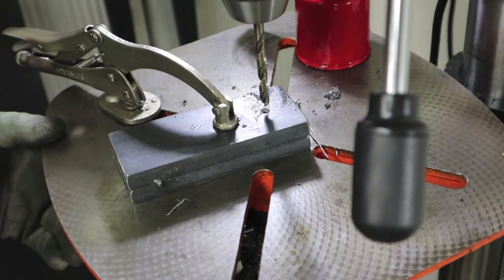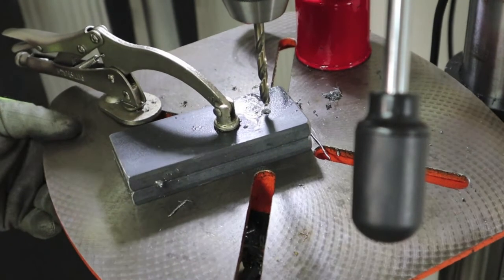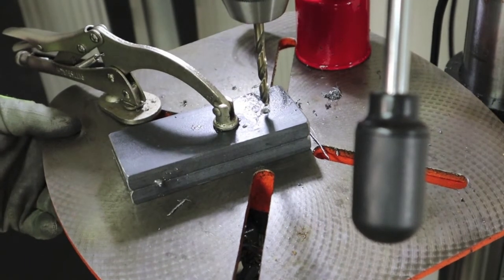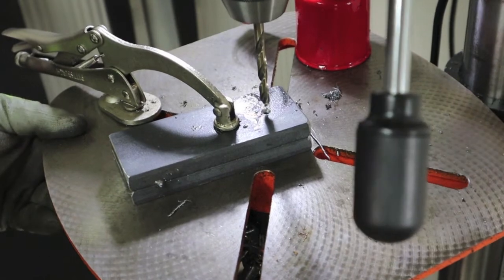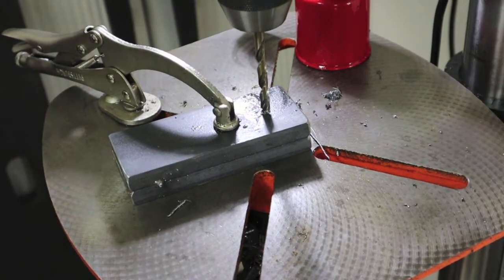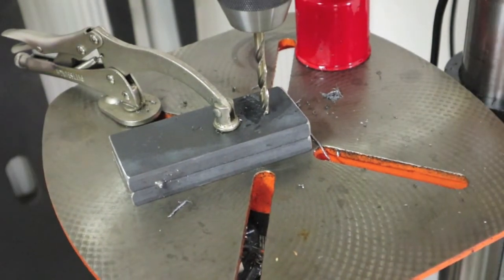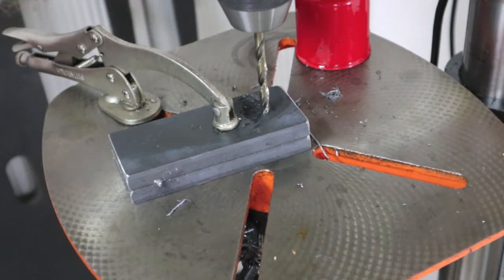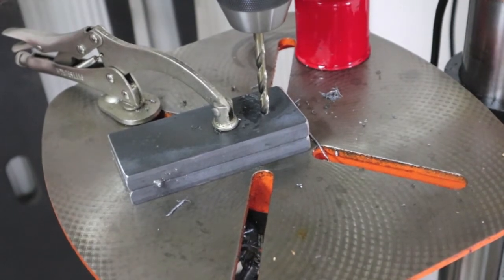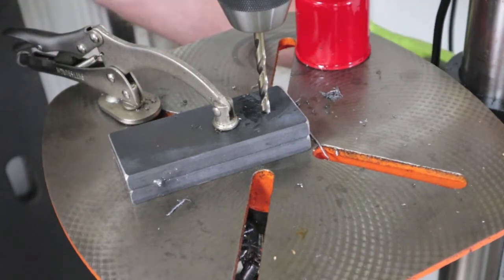One trick I picked up while watching YouTube videos by some master machinists is to leave the table loose. And I just picked up on this not too long ago. I wish I'd have discovered it earlier. But leave it loose until you come on down. You can even watch that table move. That table will actually move into place to a degree. Get it where it's right. Put a little pressure on the down handle. Go counterclockwise. And while you hold down pressure, I'm going to tighten the table.